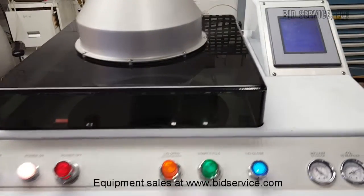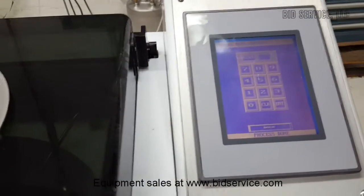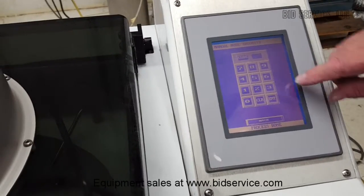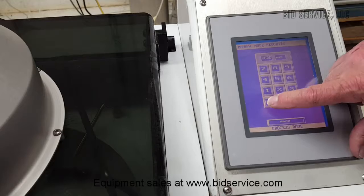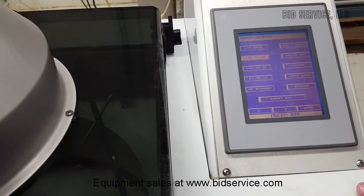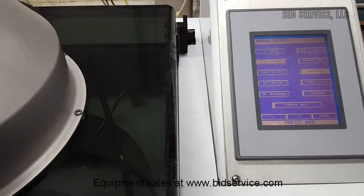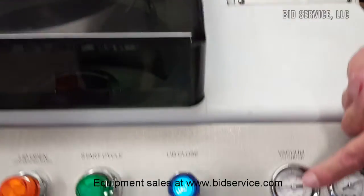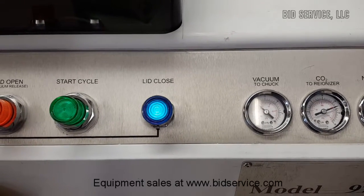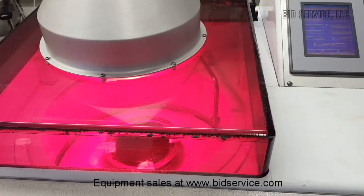I want to show a couple things here. Going back to the main, we do have a manual mode, and that's for testing certain things. There's a passcode — it's in the manual that'll come with the unit — and it's 3910. It enters us into a three-page diagnostics and shows different things that are currently going on. For instance, I can turn the vacuum on — you can see the vacuum gauge is on — then turn the vacuum off and the gauge drops. I can turn the heat lamp on so you can look in there. These are all things you can do just to test them out. You step through the pages with the arrows, and it shows you the status of different switches.